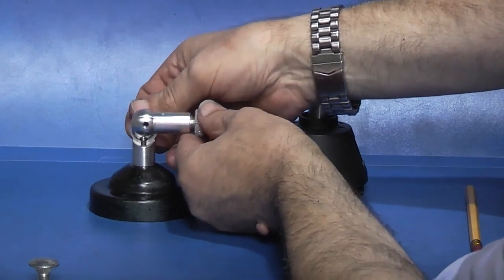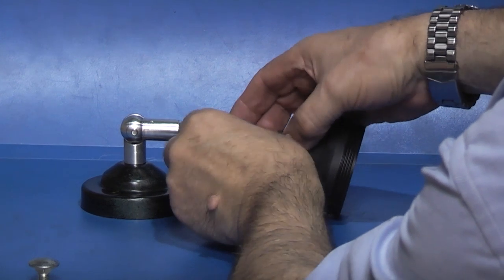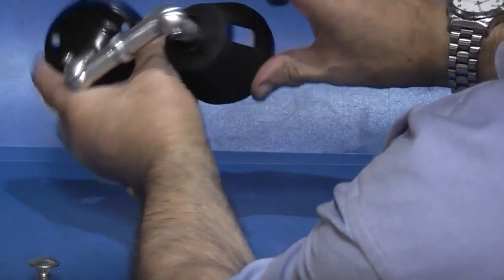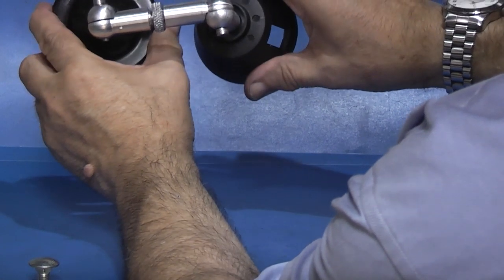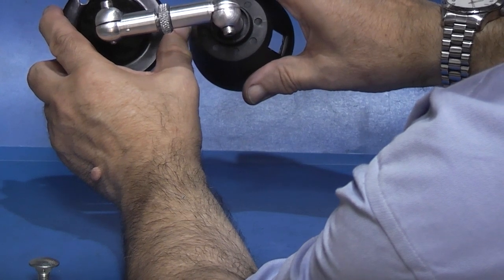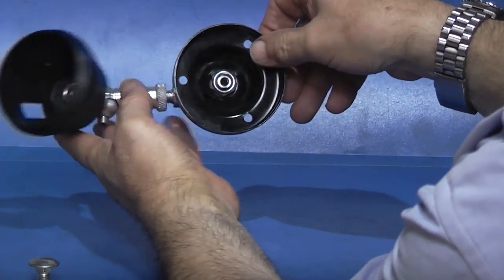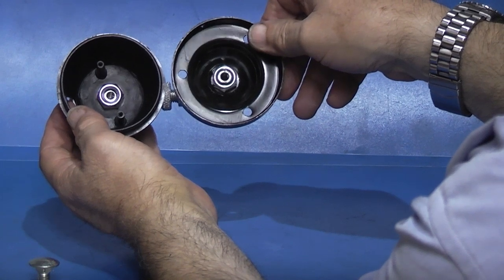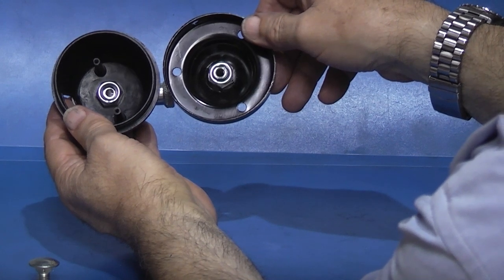This screw goes up here. This one will go on here. This part's bolted onto the machine and the switch goes on here. So whenever I set that, it'll stay there now because it's solid joints and not a flexible. The next job then is to rewire the switch, put the wire through. Well, give it a good clean first, take the swarf bits out, rewire the switch, and then we'll fit it back onto the machine.